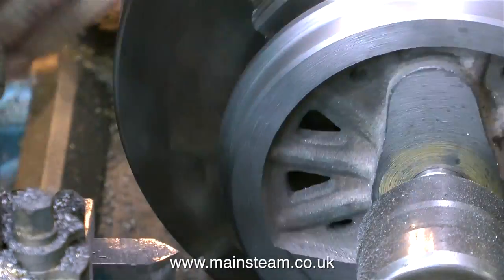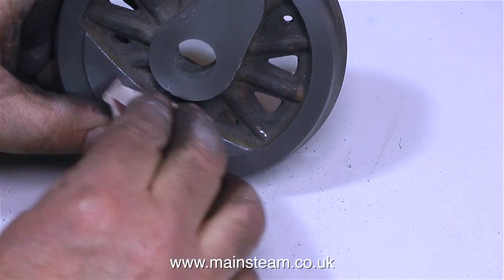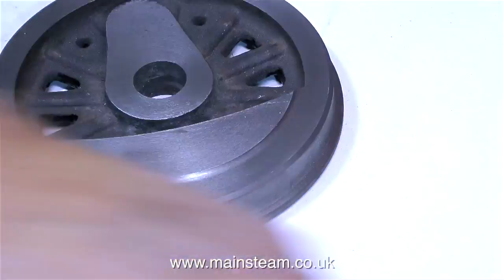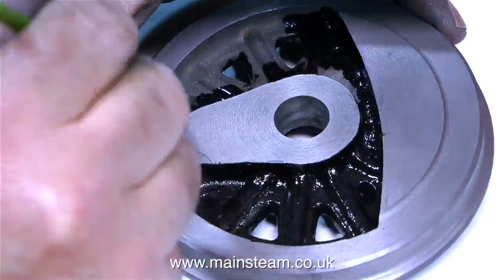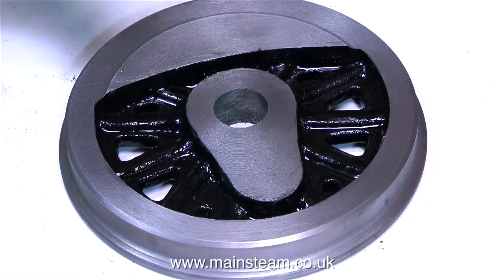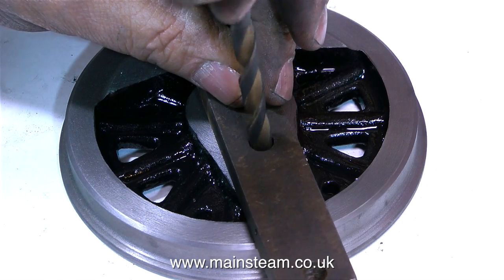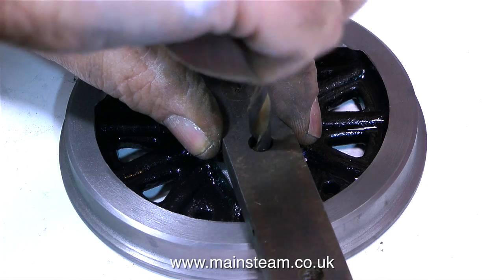I finish the job off by removing the sharp edge of the tread using a tool. To remove the axle from the wheel I just warm up the wheel with the blow lamp and tap out the axle, then remove all the sharp edges using some coarse sandpaper, after which I can paint the wheel. Some people actually paint the wheels before they machine them, but I like to paint around the nicely machined casting — any paint residue that gets on the shiny part can be easily removed. These are some jigs made for different locomotive wheels; you put the plug in the centre and this gives you an accurate positioning of the crank pin hole, making sure all crank pins are in exactly the same place relative to the centre of the axle.